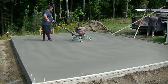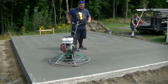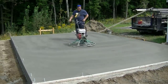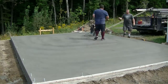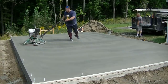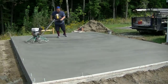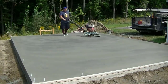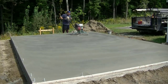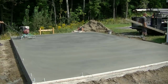This is the second time with the finish blades — Eric's going to hit it one more time. You're going to see the slab surface start to turn a little bit black, and that's when it's done — it's just not going to get any smoother than that. We call it shining out. The back half was in the sun a little bit longer, while this part was shaded by a building to the right early in the morning, so it hasn't blackened out quite as much. But you can see it shining right now, and when that's done you can't get it any smoother with the power trowel.